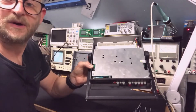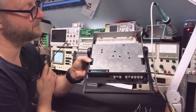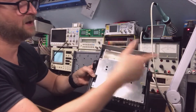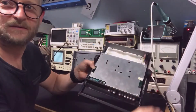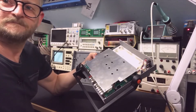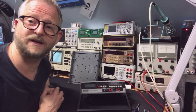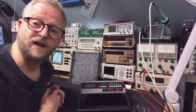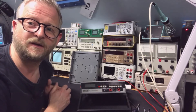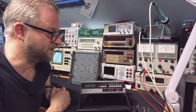I'll have a look if I can find a manual to see how much power we need. If I can't find out I'll calculate six times 1.5V which would be 9 volts. I found out you can run it between 6.3 and 15 volts, but they say it's better to use around 9 volts, so a normal DC adapter providing 9V DC will work.